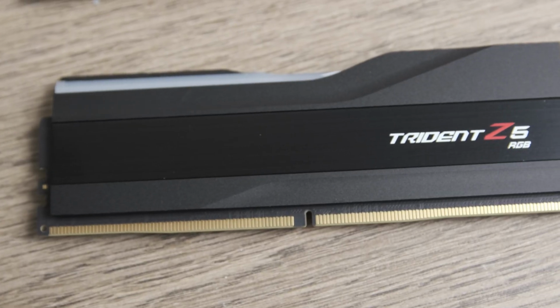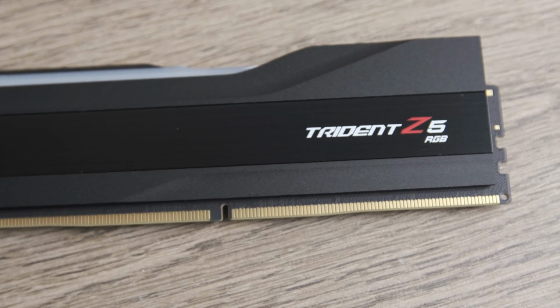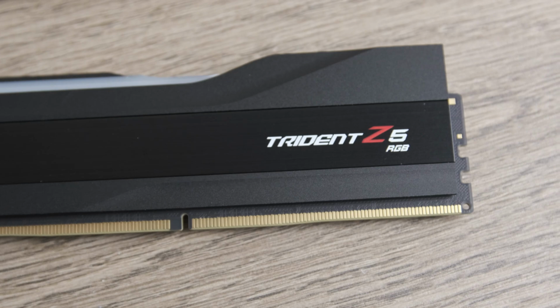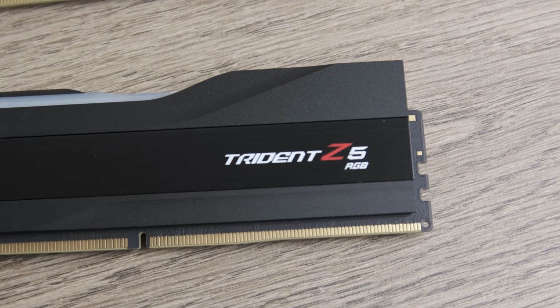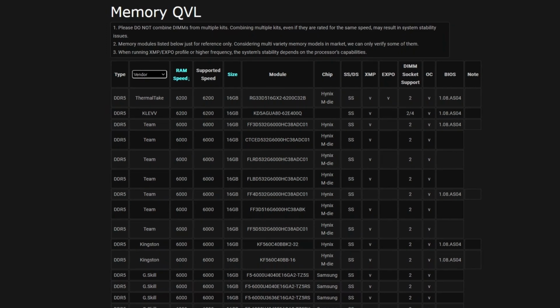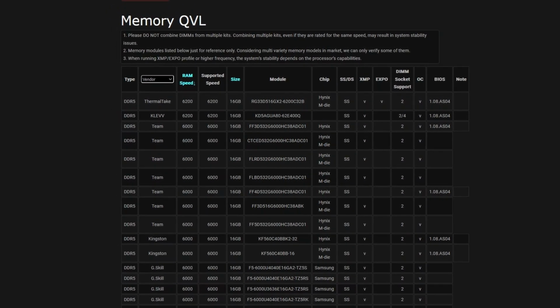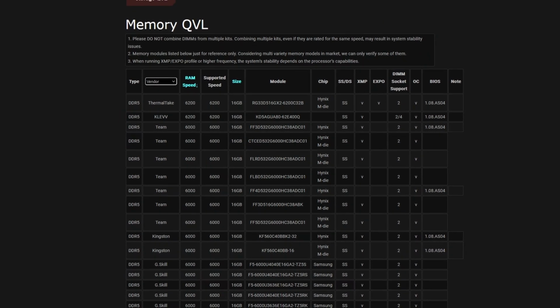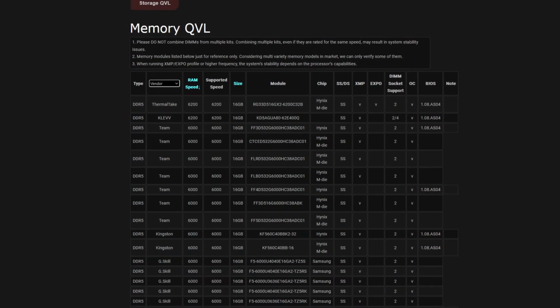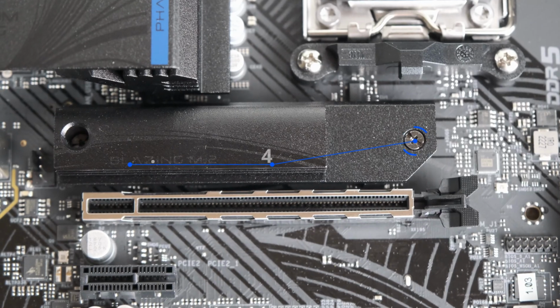This motherboard, and indeed all AM5 boards, have moved on to DDR5, and in usual AMD fashion there is a sweet spot in memory speed of 6000 MHz. This has official support for up to 6200 MHz with 4 DIMMs, and it supports EXPO profiles. Do note that the 6200 MHz with 4 DIMMs is only available with single-sided DIMMs, so not dual-rank DIMMs.